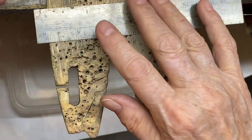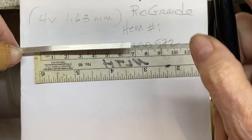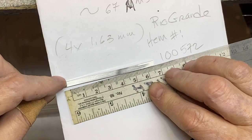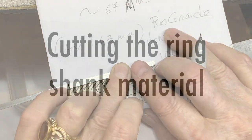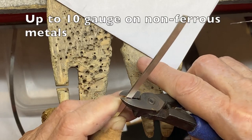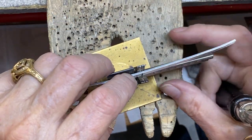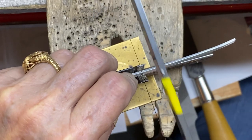I'm going to try to straighten this up. One thing you can do is tape down your ruler to hold things in place if you're having issues. Marking out 67 — double check, you want it right on 67. Let's see if my Swanstrom shears will work or if I'll have to saw. I think 18 gauge might be the limit on these shears, so I'm going to saw this. I like to use my tube cutter — I had to take off the stop since the metal's too long, but it helps keep your cut cleaner.